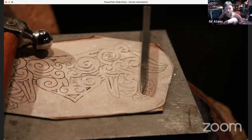And you can just go to Rio Grande and get one online. For one lining tool, I think they're like $12 or something like that. Kind of depends on what you're willing to pay. I have some really nice chasing and repoussé tools right now, thanks to Ugo making his stuff available. A little bit more spendy, but it's worth it. You want good tools. You can't just take a normal piece of bar stock from the store and expect the tool to last forever, because you have to make the surface as you need it to be. And then ideally you want to be able to heat treat it so that it is really hard. Otherwise, the metal will start deforming.